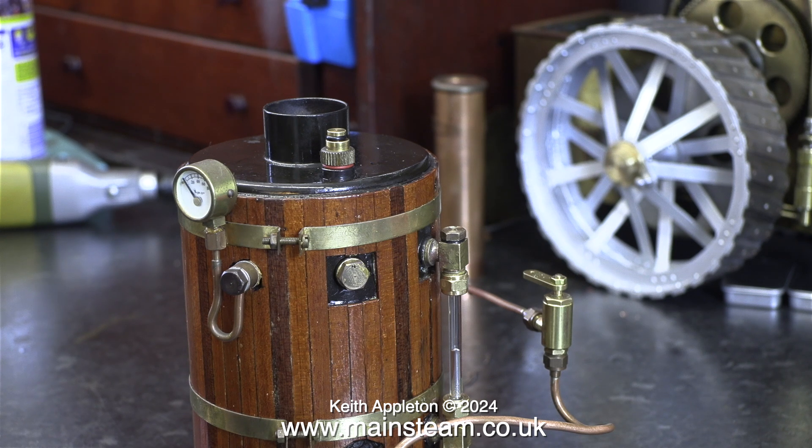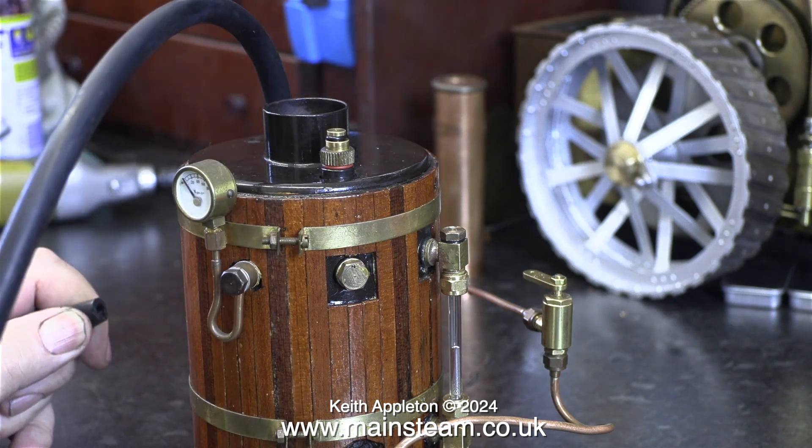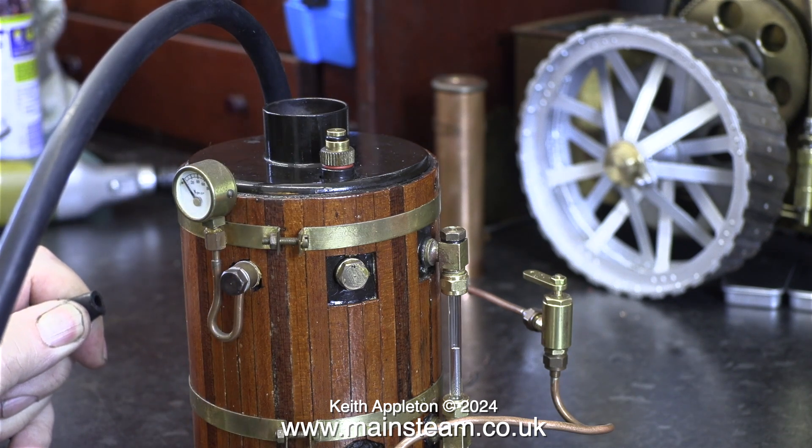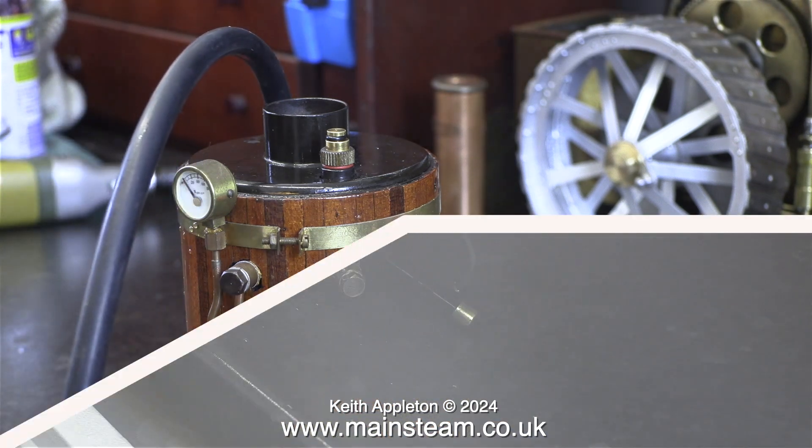The main feed to the engine is not connected, so the steam is just coming out and there is no pressure whatsoever showing on the pressure gauge. I connected a piece of silicone rubber piping to the outlet to see what happened. I was going to squeeze the end to create some pressure but it got very hot very quickly, and when I pointed the steam jet at the camera, the camera flatly refused to focus on it. Still no priming though, and the boiler test is a success.